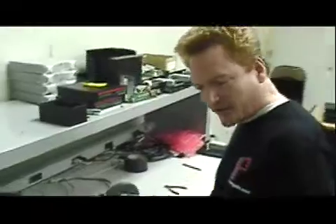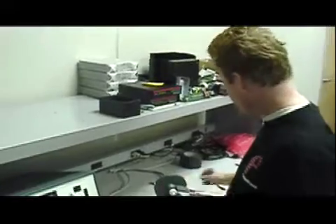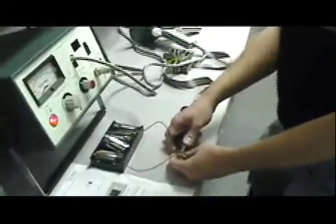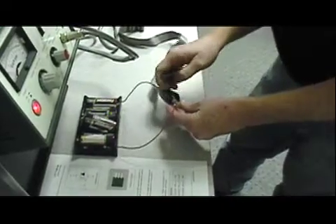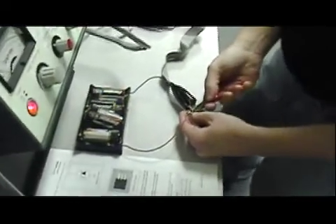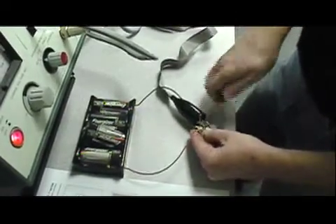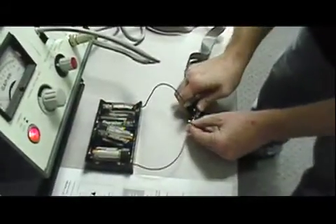This is looking pretty promising, but how do we know this isn't just a trick diode, or that everything we've heard about Blu-ray diodes isn't right, and they're actually very robust and resistant to ESD? So I'm going to cut the LASORB package right off of here, keeping everything else connected in the same way — the only difference is that LASORB is going to be gone. Now what we're left with is just the laser diode sitting here all by itself.